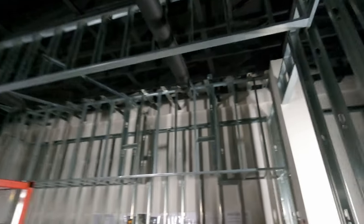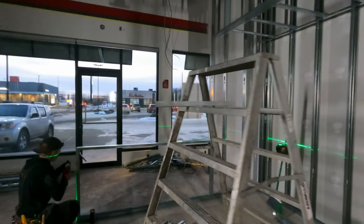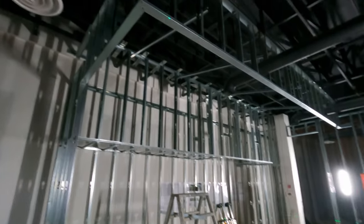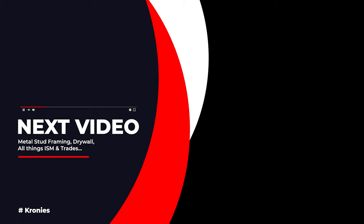The soffit on the bottom has angle on this side, angle on this side, and a furring bar — you'll see that in a second. The opening for the hoods and bracing the front bulkhead back to the back one above T-bar height — that's how it's done. You can see the clips there in action. Make sure you know your elevations, keep checking everything, same corner on the top and the bottom — done. If you have any questions leave them in the comments. If you learned something, hit that like button. Check out my on-site live streams playlist to see how we draw all this out and the T-bar finished jobs. This is Chris — talk to you soon, bye for now.